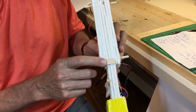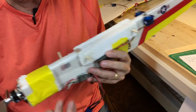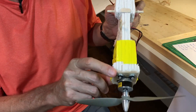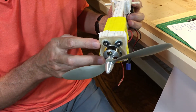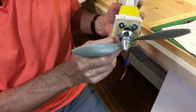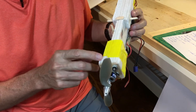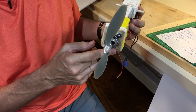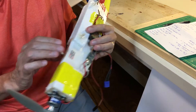A popsicle stick cutout serves as the incidence for the leading edge of the wing, and dowels on the side of the fuselage hold the rubber band that keeps the battery in place. I added side pieces to build up the nose section for the engine mount. I used one-sixteenth ply for the engine mount, which is nowhere near enough — I'll use at least one-eighth inch on updated versions. The fairly long screws are held in place with washers sufficient to add a little down thrust and right thrust, which is pretty standard for these types of models. To keep the plywood firewall in place, I drilled four holes behind the engine and inserted quarter-inch dowels sunken with hot glue.